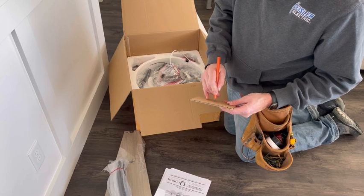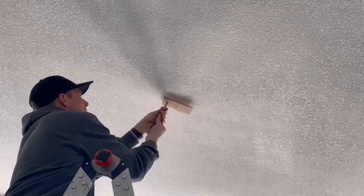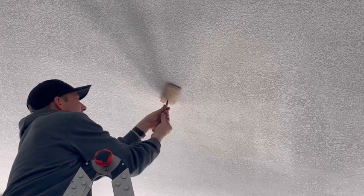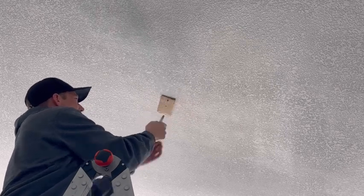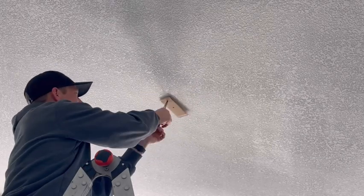Now we've made a little compass and it's time to make that mark on the ceiling. You see the point of the drywall screw — you'll take that and screw it into where the X is for your mark of the center of the circle. Grab your pencil, put it back in that hole that you made, and go all the way around and you end up with a perfect circle every single time.